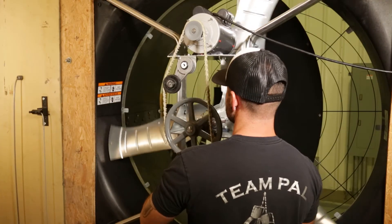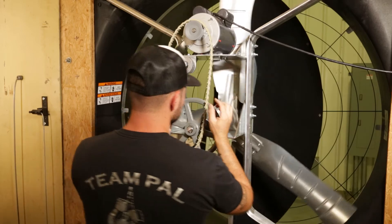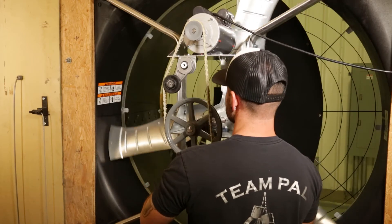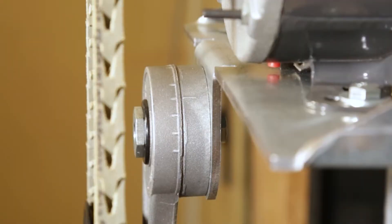Return the belt to the fan and thread it onto the pulleys. The link belt has visible arrows that indicate their direction of travel. Make certain the arrows are threaded onto the pulleys pointing counterclockwise so that they travel in the same direction as the propeller blades. Make certain it can spin the blade, then inspect the tensioner again to verify the markings line up with the second line.